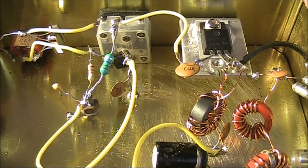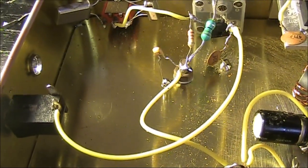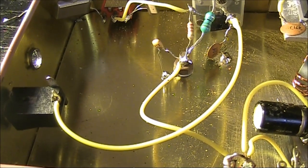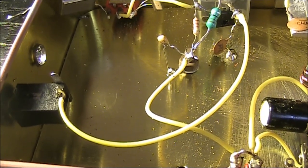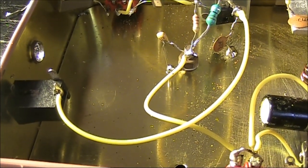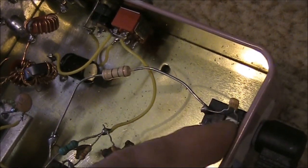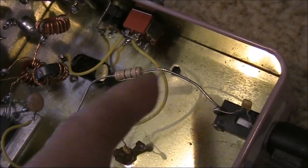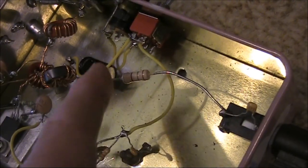Since the aim is to make this a simple transmitter with two devices only, what I'll do is, instead of connecting the emitter straight to ground when I key, I'll lessen the current through the transistor with a resistor in the emitter line, just between the emitter and the key, which is then shorted to ground when the oscillator is keyed. I've now installed a 15 ohm resistor, and also added an extra parallel capacitor across the key, around 100nF. That should provide a little bit of extra shaping for the CW waveform and reduce clicks.